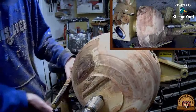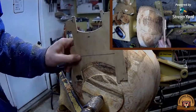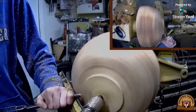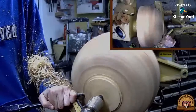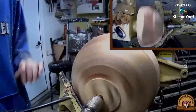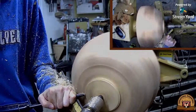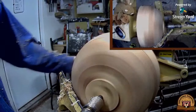So I've got to true off the tenon and get this one angled bit square. Let me see the diameter. Maybe I can make it a little smaller, and that takes away that curved bit too. I think that should fit now.